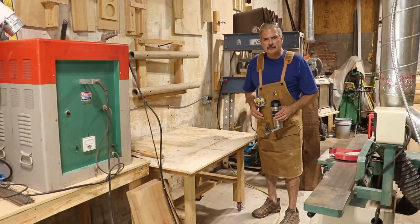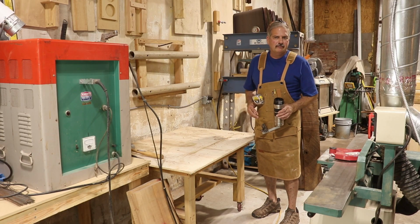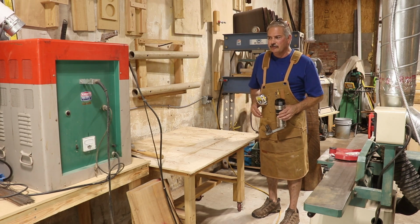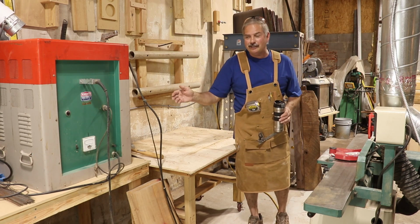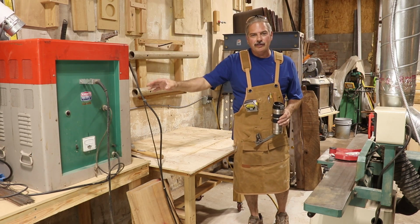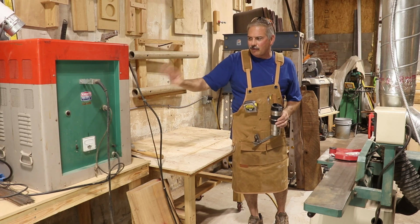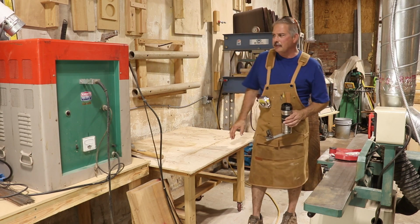This is our glue up station. This is where we make most of the blanks for our boards and our cutting boards, tables, or whatever we're doing. Just some things of interest here. We have what's called a Workrite wood welder. That's tongue tied, right? This actually uses radio frequency to set our glue. This speeds up our glue up process tremendously.